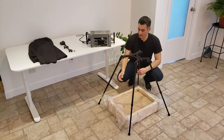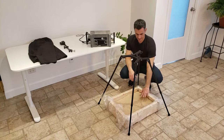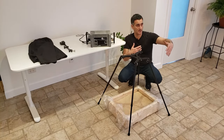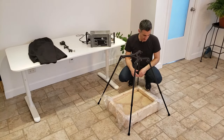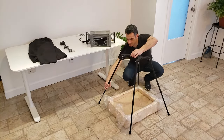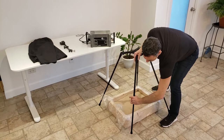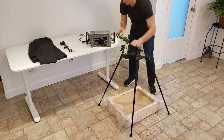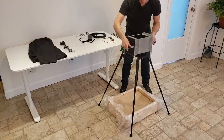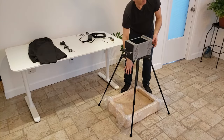It comes with what I'd call a quad pod — basically a tripod specifically made for this particular scanner. The distance from the surface to the lens is important — the standoff distance matters. If I extend these legs fully, I should be able to get the proper distance. The sand is a little bit higher but it should still be within the range of optimal focus for the cameras on here. You just put it down and then hook it up, and it would be pointing straight down.